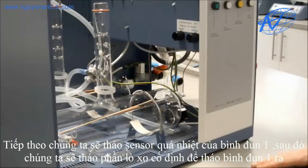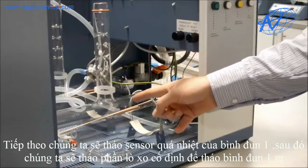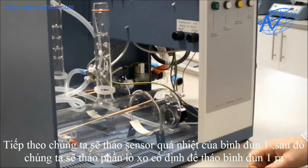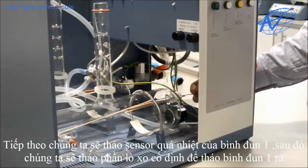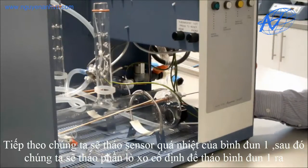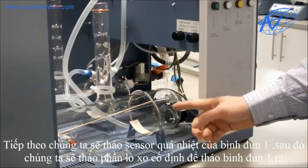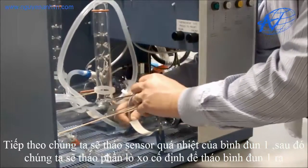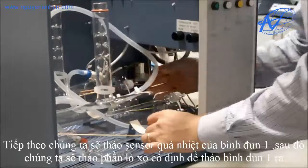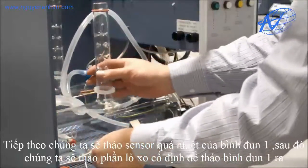The first thing to do when setting up the unit is to remove the front boiler. You must first remove the metal thermostat which is inside the thermostat glass tube inside the boiler. To do this, just pull the thermostat metal bit out gently. Remove the retaining springs and the boiler can be lifted straight out.